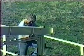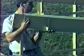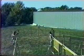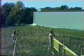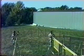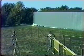Now it's time to put up some of the rafters. The straight back-to-back channels go from eave bracket to aisle post. They are held in place by 4 bolts. This end rafter closes up the end wall of the barn. They bolt to themselves. The vertical tubes are to accommodate the exterior covering you desire to use on the outside wall of your building. If you desire a window in the end of your barn, it would also be put into this rafter.